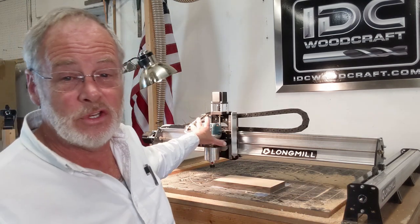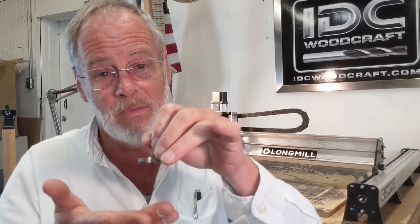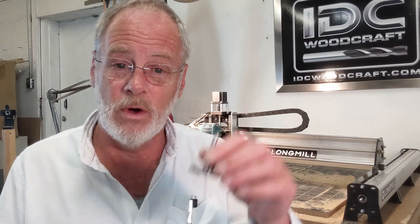If you have a machine like the Phantom CNC router — the floor model I recommend for serious CNCing — that has a much more powerful spindle. Important note: if you have a 2-horsepower spindle on a benchtop, you can go deeper — up to an eighth of an inch depth per pass. With trim routers, never go past 0.07 depth per pass; with 2-horsepower spindles you can go up to an eighth of an inch; and if you have 3 horsepower or higher, you can go almost the full depth, which is a quarter of an inch. With a machine like the Phantom CNC router, you can take the full depth of this bit.